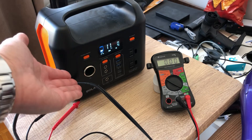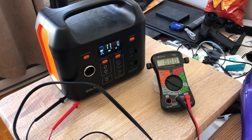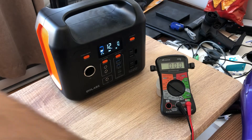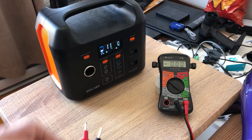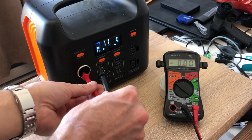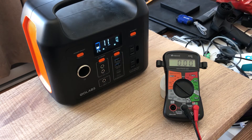Some people say it's gonna go down until there's no more power — that it's gonna drop all the way to 0%. But at 27% this thing is still going strong. Let me measure the current one more time. Without any load it's at 12.94 volts. Even under load it's still above 12 volts, close to 12.5 — so plenty to run your CPAP.